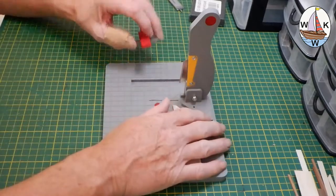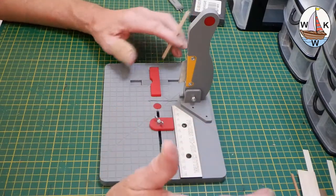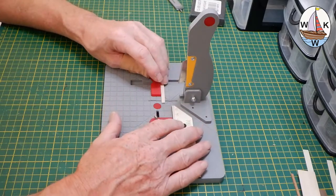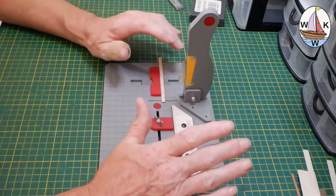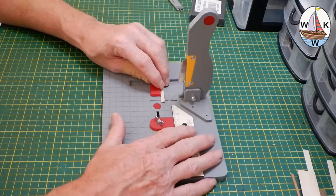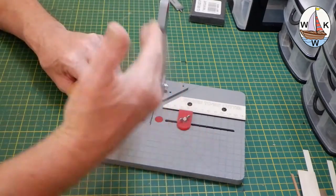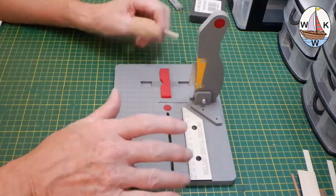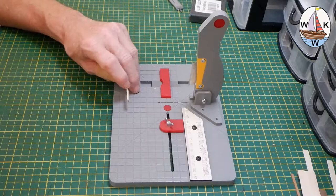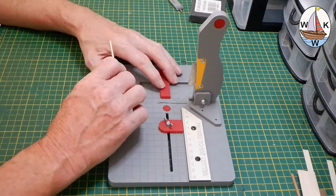The sole reason in life for this tool is to be a cutter, so I'm testing it without screwing it down, because that's the way I bought it and to me that's the way it should be tested. I will at a later stage put it on a board and re-cut things just to show the difference. One reason I bought this one was that because it has a utility knife blade, which is thicker than average cutter blades, I reasoned that might stop it from deflecting so much. It really doesn't.